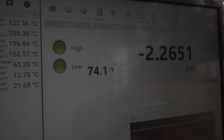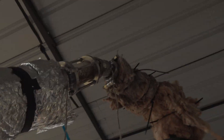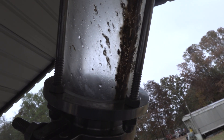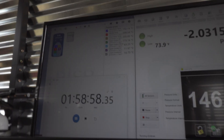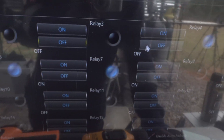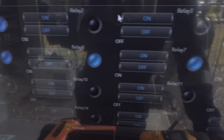We're at 200°C in the middle body temperature — getting pretty hot. The negative pressure is at negative 2.2 psi, 133°C on the infrared pyrometer. The infrared pyrometer is supposed to measure the internal temperature, but I don't think it's doing its job — it's probably still measuring the metal from the inside. If it was measuring the plastic directly, it would read way hotter than 133°C because plastic doesn't even break down until about 300°C. The oil gets even darker. We're almost two hours in. I moved the blades to get most of the plastic to the front of the machine, so I went ahead and turned the back magnetrons off — no point having them on when all the plastic is in the front.